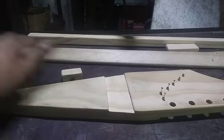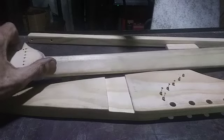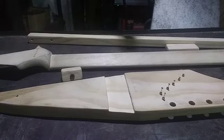And that'll just clean up any dirt that's embedded in the wood or anything. It's really not that critical because I'm going to stain it black, I'm pretty sure. So that's the next step, raise the grain and knock it back down with some sandpaper. And then it's time for a dye job and clear coat.